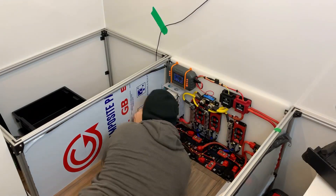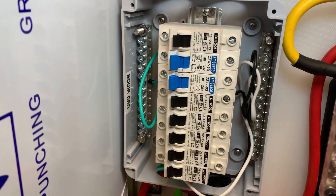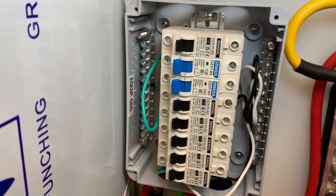Lastly, connecting the green ground or earth wire to the ground bus. With the pin lugs protecting the ends of the wires and the screws nice and tight, it looks like we've got our first circuit wired in. I'm sure you'll have some questions and I'm sure I'll have some answers, but I hope you enjoyed that video. If you did, please hit the like button, subscribe if you haven't already, check out the links in the video description, and most importantly, come back next time. Thanks for watching.